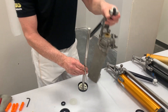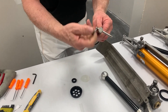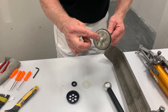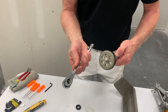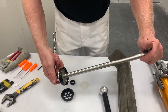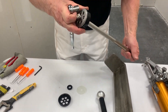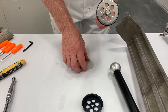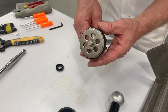Remove the pin, take this all the way out, then put the pin back in — you'll use that later. The reason is that when we remove this part we're going to use a ratchet. This is a 9/16 ratchet and it fits on the bottom here. This is a lock nut, and it's obviously very slippery so you can't hold it. Hold your hand on the pin and then remove the lock nut — it doesn't have any washers on it.